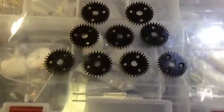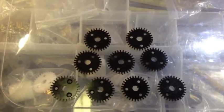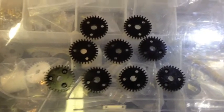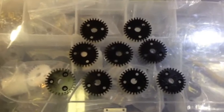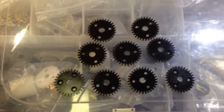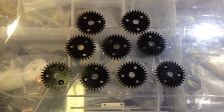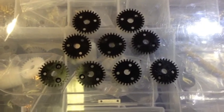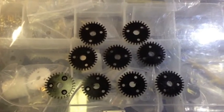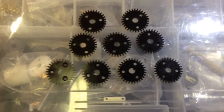Anyway, there we go — and here they are, all done. Notice that there's only 9 of them; I had milled 10. That one that had popped the tabs while being milled had a couple of teeth mangled, so I can't use that. But the rest of them came out perfect and they've been countersunk — you can see the three holes around the center are countersunk a little bit. That's for a flathead screw that attaches it to the back of the spool on my fly fishing reel kits. They look great, so I would say my G0704 is ready to put into service. I'll do a little more buttoning down — I've got to figure out where to mount my motor controller. My flood coolant is all ready to go, the enclosure is all set. Just button things up and ready to rock.